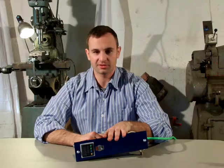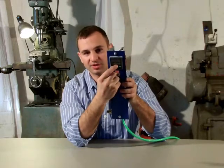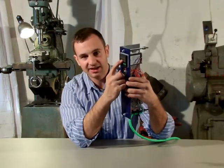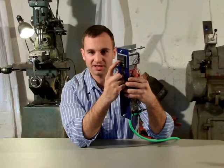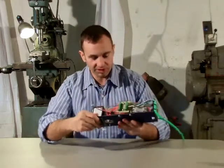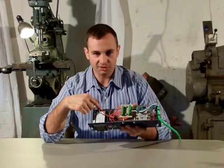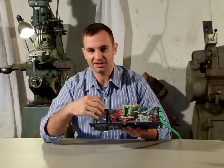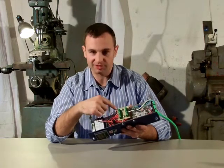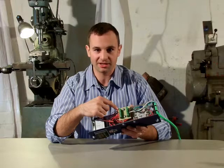The next part I'm going to introduce is this temperature controller. You can see it has this PID controller in the front that has 2 displays. One displays the actual temperature of the barrel directly from a thermocouple, and the second is the temperature you set by hand. You can see how close they are, so you know when to inject and when to stop and when to wait. A unique feature of this controller is that it has a solid state relay directly driven by this PID controller, so you get much faster switching and much more precise temperature control. And you have a circuit board up here where you have labels for each wire, so you don't even need a wiring diagram. You'll be able to wire it up right out of the box by yourself.